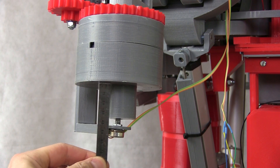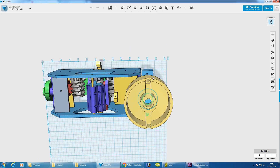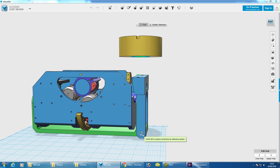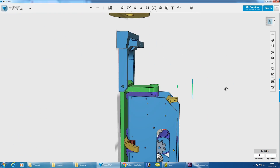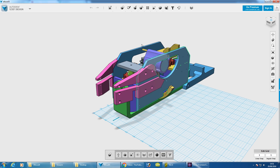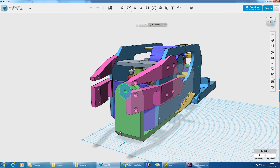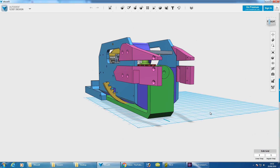Below that is the pot that measures position as well as the nuts that hold the studding on — it sits on a bearing so there needs to be a gap there. I've got the studding extended from there and left holes in the sides of this piece to fix the lower arm on, with adjustable height. I started to work on the forearm and the hand mount — essentially the hand is going to be mounted to this whole assembly and rotate with it. I've got some nice cutouts so the cradle can go between it, rotate around, and we should still get our 60 degrees or so. Then we'll have a block mounted on the front with the hand rotation and series elastic actuator.